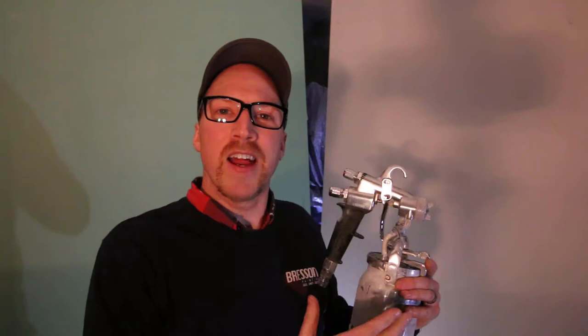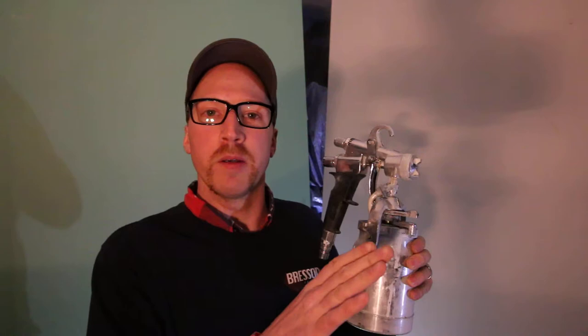What is an HVLP? It's a high volume, low pressure system. It's not your airless sprayer. You're not going to spray your entire exterior of your house with this. What you are going to spray with this is probably going to be your interior. Not your interior walls, not your interior ceiling, but your interior trim and your doors.